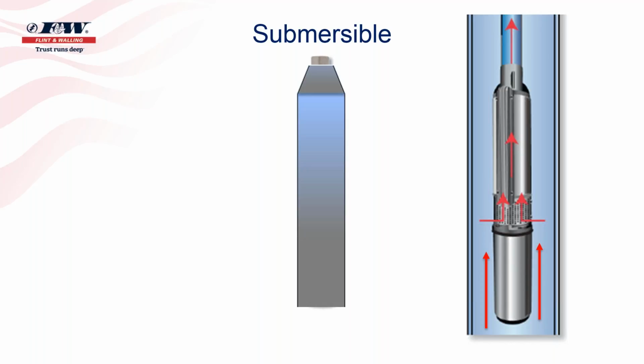But when you start talking about 3 or 5 or 7.5 horsepower motors or larger, you want to be sure that if you put that kind of a pumping system into a large open body of water, you shroud that pump. And I try to give you some indication of what that shroud would look like. It's basically a sleeve that goes over that pump. It connects up at the discharge, but in order for the water to be pumped, it has to enter through the bottom of that sleeve.